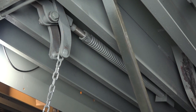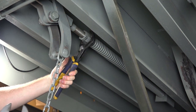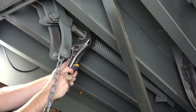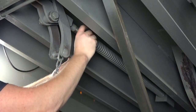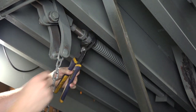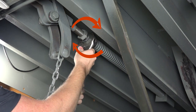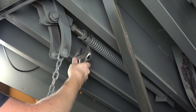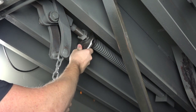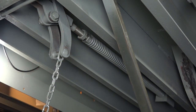To increase the lip-assist spring tension, we need to loosen the jam nut that is holding the adjusting nut in place. With the jam nut loose, we can move it out of the way and use our adjusting nut to make the adjustment. To increase the spring tension, we want to move in the clockwise direction. Again, only move a half turn at a time and then verify leveler operation. We might not need more than a half turn since we were already close to the 18-second range.